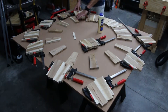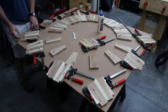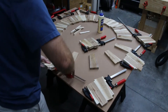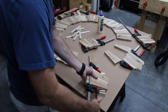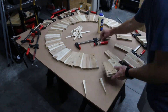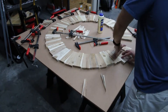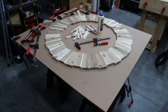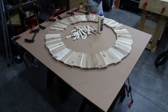For the first phase of the glue-up, I just did two pieces at a time, and that really went pretty well. Especially because I had so many of those little cutoffs, I could put those on either side of the glue-up and get a nice seat on the clamping surface. The other thing that helped was to not move the pieces at all — I could always keep them exactly where they were once I got it laid out. You can see me there just slowly sliding each section right back in to where it was when I laid it out on the table.